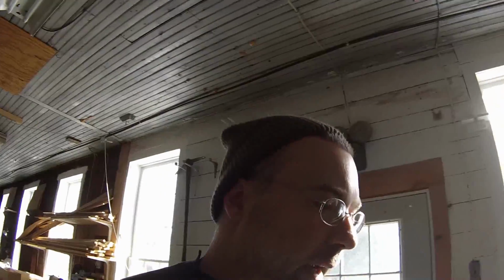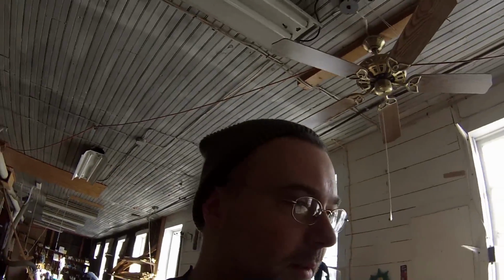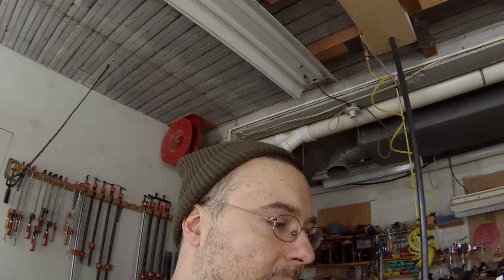I've noticed that some people design dust collector systems with hanging pipe in their shop, and they seem to use an excessive length of pipe to connect to their machines and to connect to their separators, and you really have to keep in mind that you need to minimize the length of piping that you use in your system to connect all of your components, because your static pressure dissipates very rapidly the longer length of pipe that you hang in the shop.